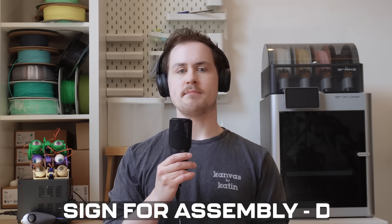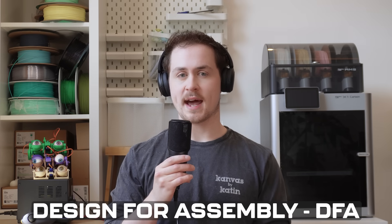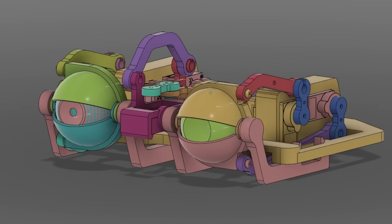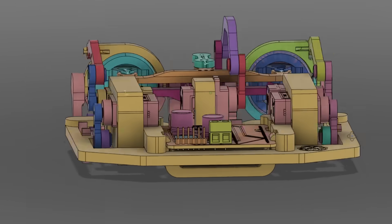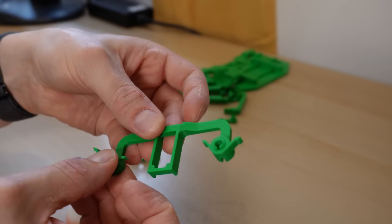So what is the point in changing the design in this way? In engineering and product design, design for assembly, or DFA, is a methodology used to improve a design by considering how it actually gets put together. It's a subject you can get really deep into, but at a high level we're aiming to reduce the number of parts and make the design simpler and easier to assemble. Snap-fits are an easy shortcut to improve a design in ways which would make it perform better in a DFA analysis, but without having to necessarily use your brain too much.